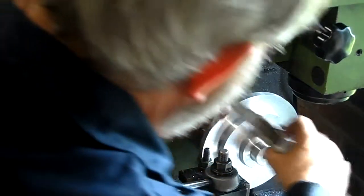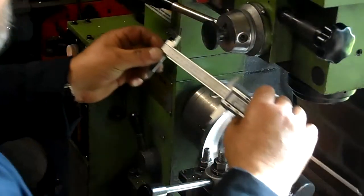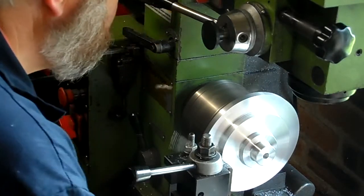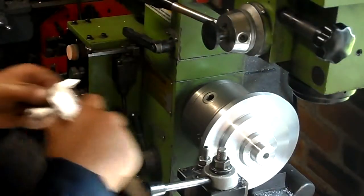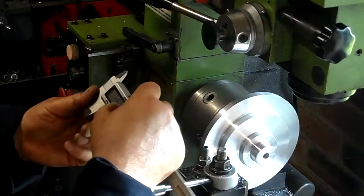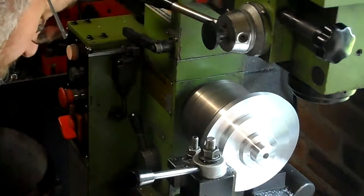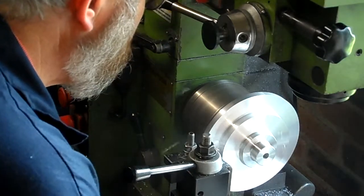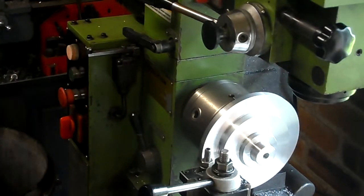Let's see how close we're getting — it's about two and a quarter millimetres to come off. It's hot, I'll have to let it cool down a bit. 121 — off it. 120.6 — that's very hot. I shall let that cool down a bit before I do the final size on that one, because it needs to be a reasonable fit on this sprocket.